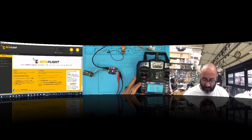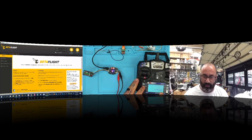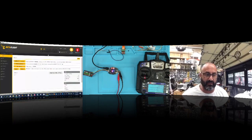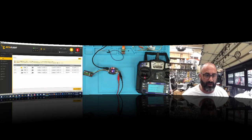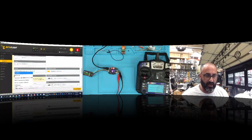Under the radio's system settings, scroll down to RX Setup and make sure you have AFHDS 2A selected. Then go to PPM Output and set it to S-Bus/PWM since we're using PWM. Now in Betaflight, click Connect. Under Ports, you don't need any ports activated. Go to Configuration and in the receiver drop-down, select 'PWM RX input — one wire per channel.' Click Save and Reboot.